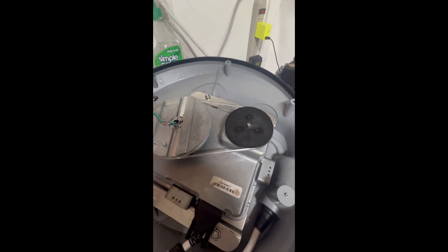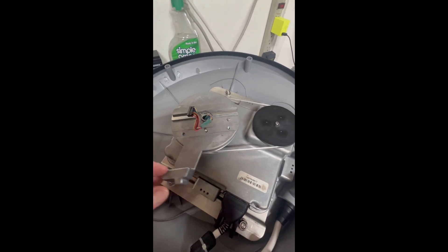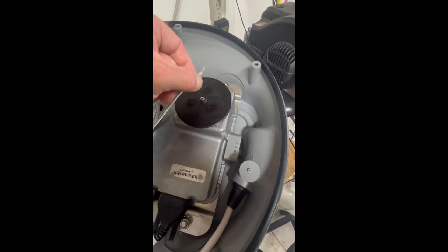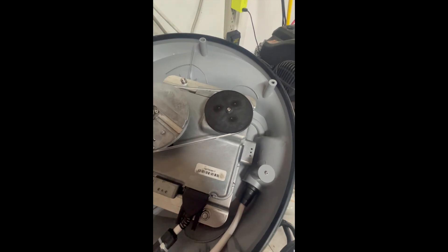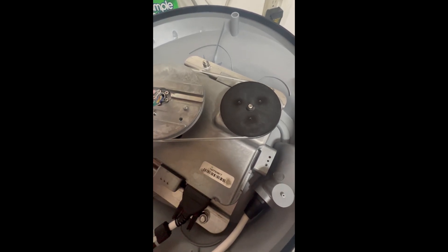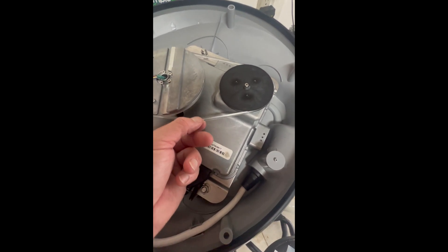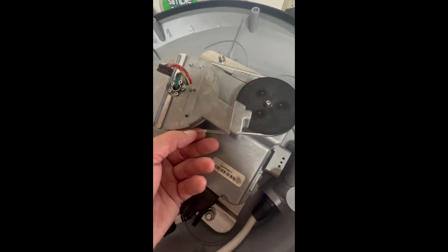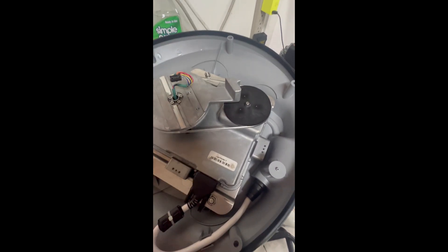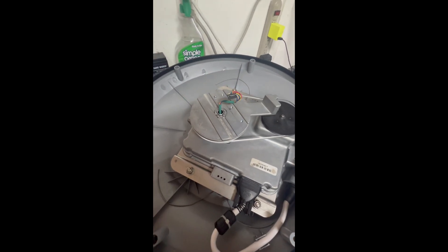The 22.25" belt was actually a little loose. The 22" fit pretty well but still wasn't super tight. The 21.75" fits just right — it barely goes on there but has the perfect tautness. This material doesn't have a lot of stretch, so that tension matters. You could probably try 22" or 21.5" as well, but 21.75" was the final one that worked. I'm glad I ordered three sizes.